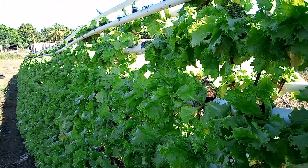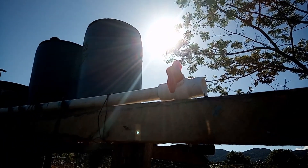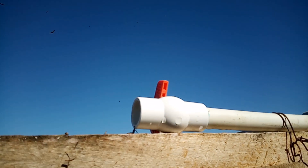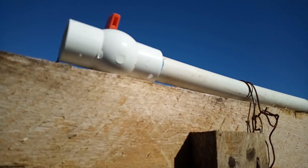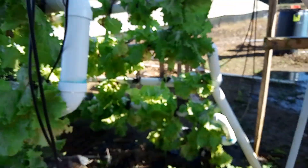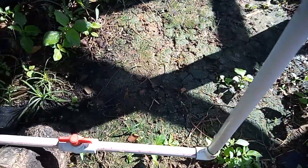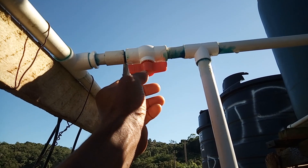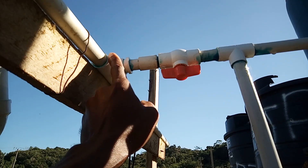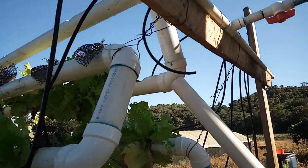On this side you can see all the micro tubes. There is also a lock-off valve — if the system gets airlock, we turn on this pipe to let out all the mixture and any debris inside the system. There is also a lock-off for the pump, so we can turn it off if we don't want the pump running water back down that line. Up here we can also turn off the water going to gravity-feed through the micro tubes, and we can turn off the drum's gravity feed as well. This is how the system works.